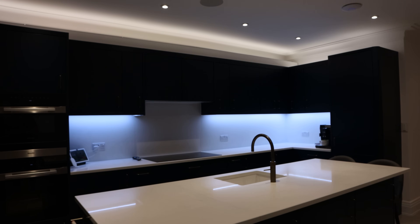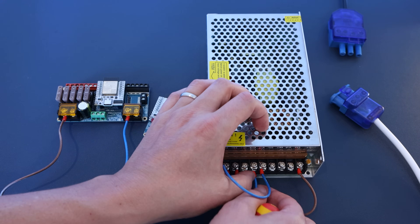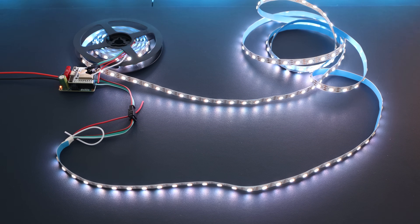I planned on buying the cool white version for underneath my top cabinets and the warm white version for the tops of the cabinets. I also liked the fact that these were 5V strips. This low voltage makes it much safer for a noob like me to play around with the wiring, as it's pretty much impossible to push enough current through 5V to start any fires or melt wires. Unfortunately, 5V LED strips are more prone to getting dimmer as the length increases, because the lower voltage makes it harder to push the current down the wires — you end up suffering from something called voltage drop. But there are ways around that, which I'll explain later. Another reason for choosing the SK6812 is the density of LEDs — I was able to get them in a 60 LEDs per meter configuration, unlike some strips which only have 30 per meter. The more LEDs per meter, the more even the light looks, and you don't end up seeing hot and cool spots. You can get more LEDs per meter as well, but that means more power, a bigger power supply, and the whole thing gets more complex and expensive. These LED strips are also individually addressable, meaning you can control each single LED on the strip individually, allowing really complex patterns and lighting sequences.